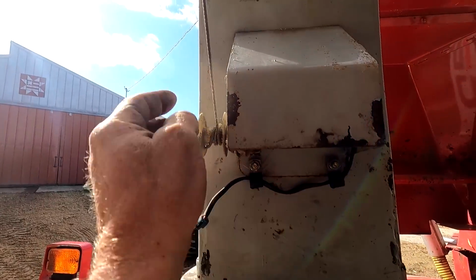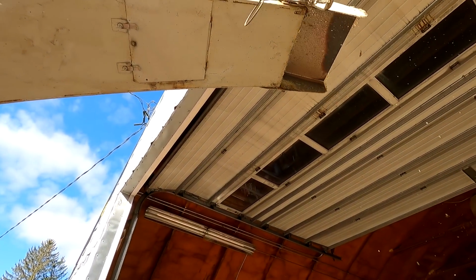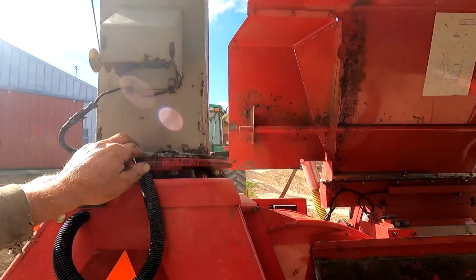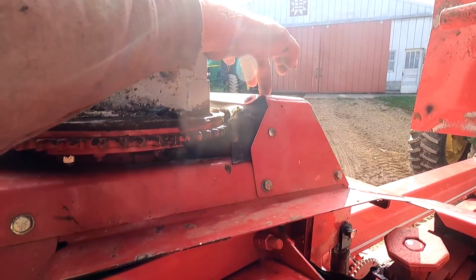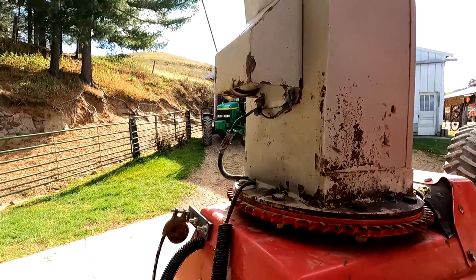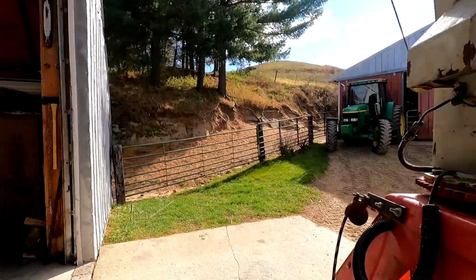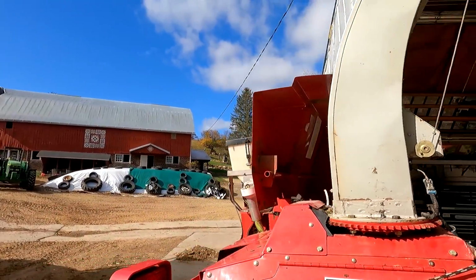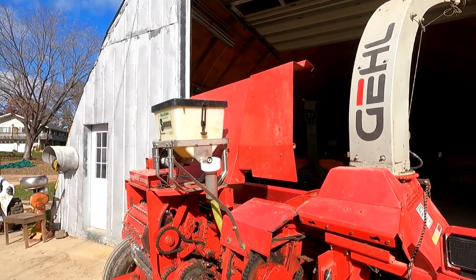There's a little motor up in here that operates this cable, which, let's see how that flips. And that works from the cab. And then you have this big gear on here. There's another one underneath this box that spins the whole spout. So it turns the whole spout. If you were going around a corner, especially with hay, it seems like we're moving that all the time in these crooked fields. So it gets to be quite a bit, and all those components kind of work together.